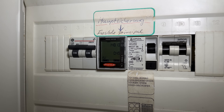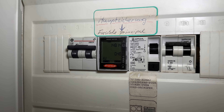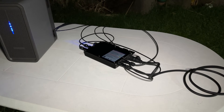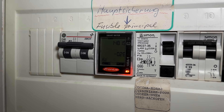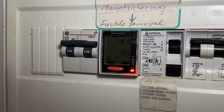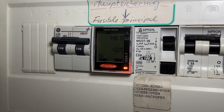It's night now and current usage is around 480–490 watts. I've used the app to turn on the discharge — the battery is feeding into the micro inverter, which is now feeding power into the grid. Back at the smart meter, it's showing negative 0.26, meaning I'm putting 260 watts back into the grid, covering all currently running appliances with the roughly 800 watts being sent to the house.